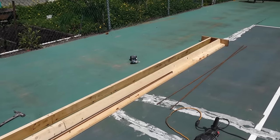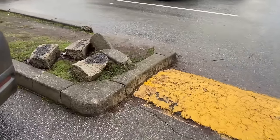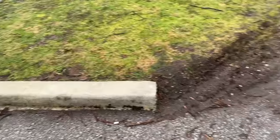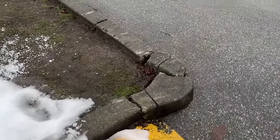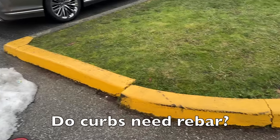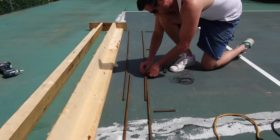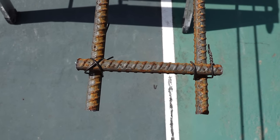Once the forms are fastened it's time for rebar. Some of you might be thinking — does a curb really need rebar? To answer that, I took a trip to a local high school where they clearly did not think the curbs needed rebar. They've been making repairs and the repairs fail. You just cannot count on curbs to stay together if people keep driving into them — it's comically bad. So yes, curbs do need rebar. I used two rows of 10m rebar, overlapping them by about a foot, with little cross sections to hold them the right distance apart.